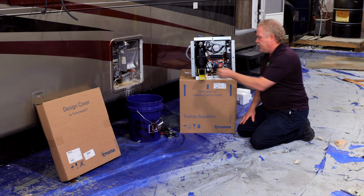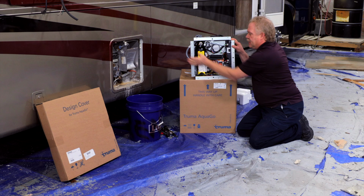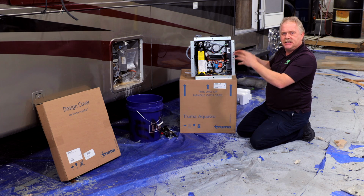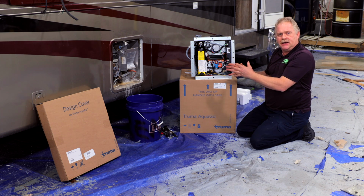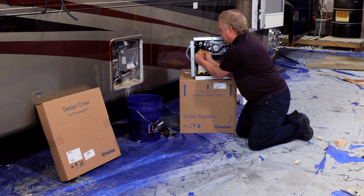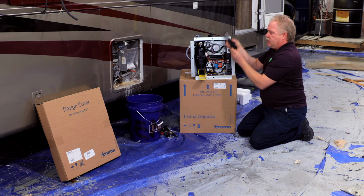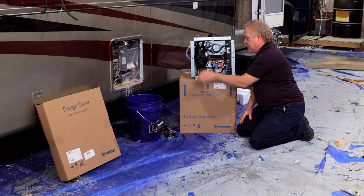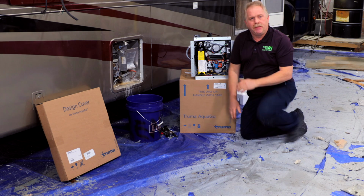To install this, very simply, you just install it where your drain was and flip it up. Now you have a draining system that will always allow air to come into the actual mixing vessel and keep water from accumulating on the inside. So to replace it, you very simply just lift this up, pull that down, pull out your adapter, your drain, take your original drain, put that back in, just like that, and you're back to camping.